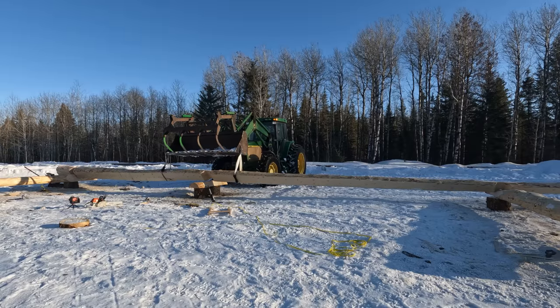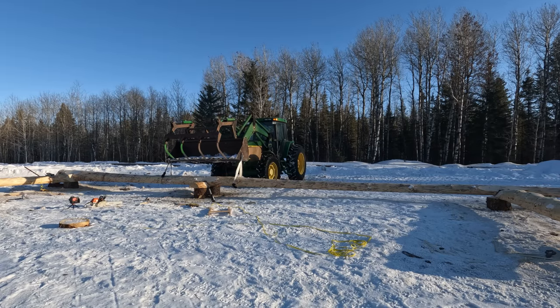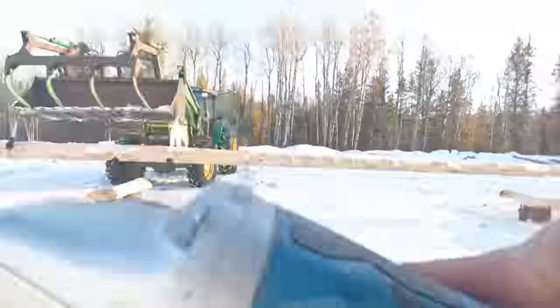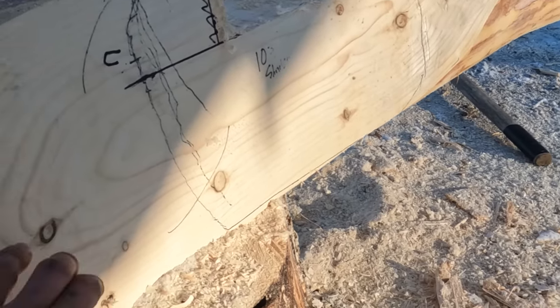The truth is, friends, I would not do these half sills the same. They look good, they look big and strong, but what I thought I was gaining, I didn't really gain. And that steep and deeper saddle, I did not like notching over that as much, and it would have actually been better to have them smaller. It has to go exactly where I scribed it to. So I took the mallet and beat the hell out of it.